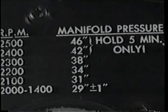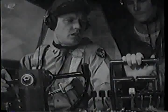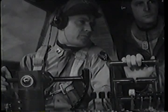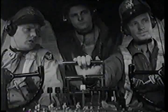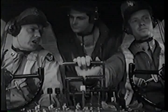The power setting used in normal cruising is always figured from your flight conditions. Desired range, fuel available, weather conditions, altitude, gross weight, and perhaps one or two other things. In special cases, you'll always figure your best power setting from your flight computer. All settings are arrived at scientifically. Don't improvise. Plan the way they're written. And always keep an eye on your mixtures. In auto lean, don't use more than 29 inches with 91 grade and 2,000 RPM.